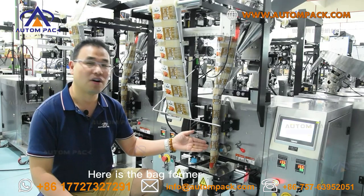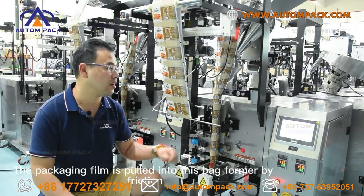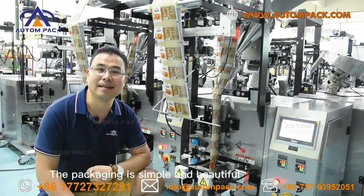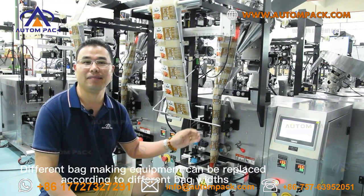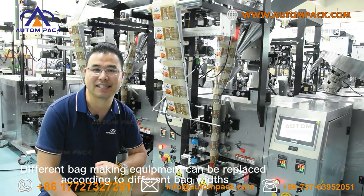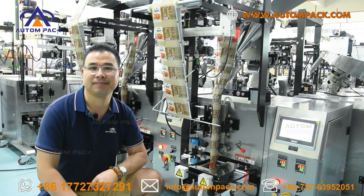Here is the bag former, made of 304 stainless steel. The packaging film is pulled through this bag former by friction. The packaging is simple and beautiful with a human-like design. Different bag making equipment can be replaced according to different bag widths. One machine can pack bags of various sizes.